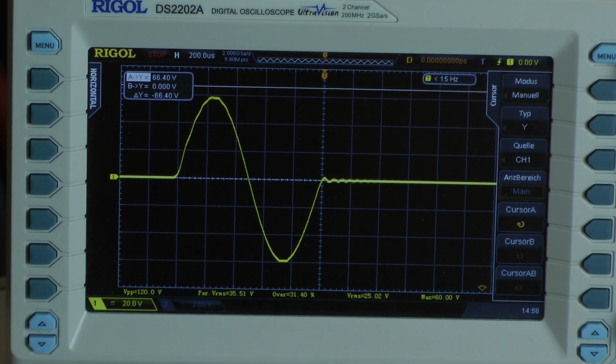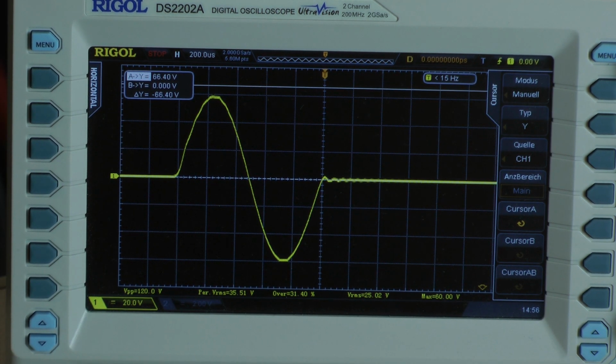At 4 ohms per channel, I checked for some dynamic headroom, but the amplifier delivers no dynamic headroom. I guess it will do at lower impedances. I have 1 kHz, 1 millisecond, 8 millisecond, 20 millisecond and even the 50 Hz burst test. The amplifier is doing 115 watts.